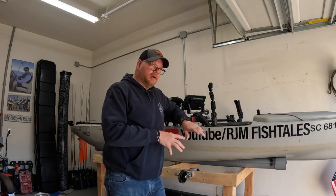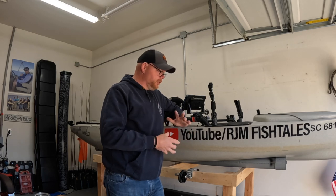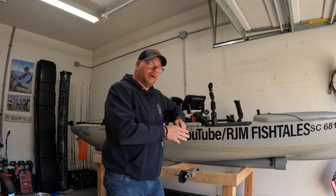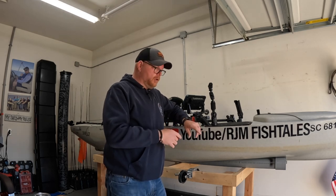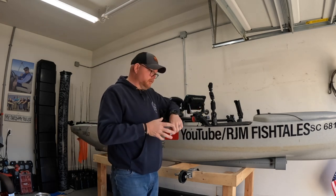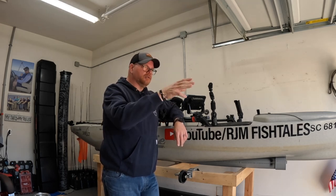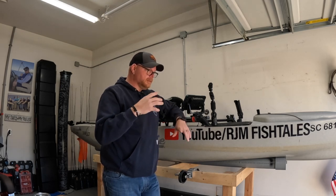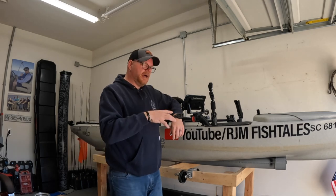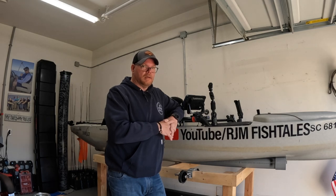I hope this video gave you a little explanation of how I built this cart. It's very easy — all you need is some basic hand tools, cordless drills, some screws, and at least a circular saw. I actually used my chop saw to keep the edges nice and square. You can do a square cut with a circular saw by running your rip fence against a square on the two by four — that'll give you a nice clean cut. I showed you how easy it is to load and unload from the truck, keep everything together and organized, and it'll prevent you from forgetting things on the water. As always, don't worry — fishing is coming. Until next time, be safe on the water and I'll catch you guys out there. Thanks for watching.